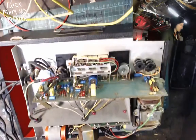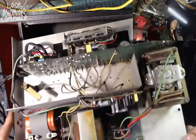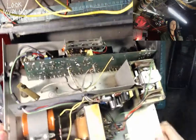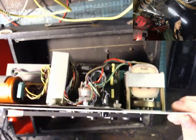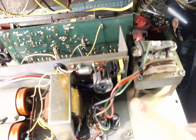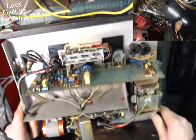So what I'm going to do. This is the bottom, that's the top. If you look at the top, I can't really put any switches here because there's a massive space right at the top here. This is right behind the logo, and you don't want to go through the lovely logo. Plus it's right next to that big buzzing 220 volt motor and the power supply, which is just over here. You don't really want to have the audio coming out next to 240 volts. You might get some buzzing and stuff, so maybe not.